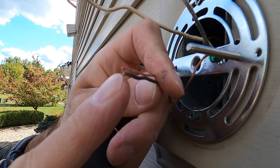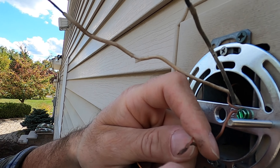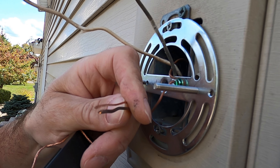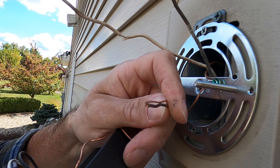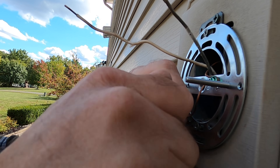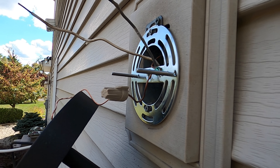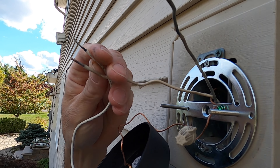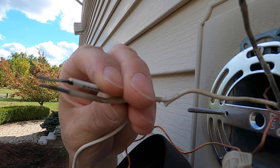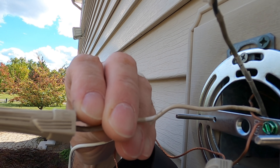I'm going to put this over and get my wiring through, and put the mounting screw in. You can cut these screws shorter. To keep the fixture level, you can see how this mounting bracket will rotate — so if your box isn't straight, you can compensate for it. I want to make sure this is level; I've switched the level vial around. If you put this up by eye, your fixture can be crooked. So I'm going to level the mounting bracket as I install it, and then I'm sure the fixture will be level when I get to that point.